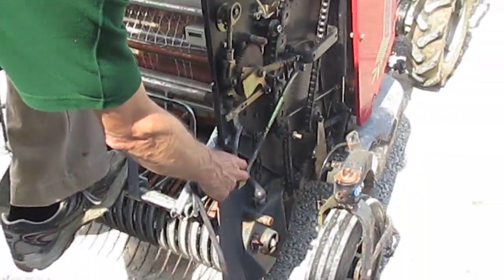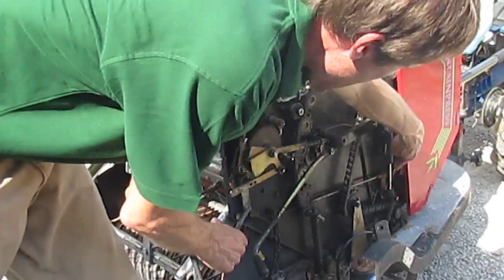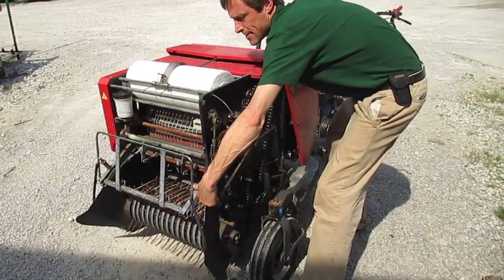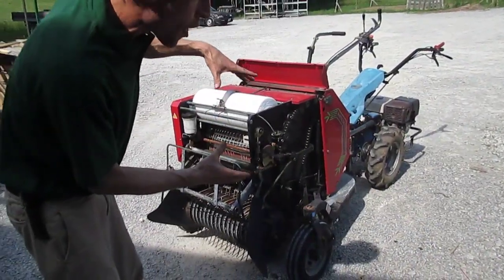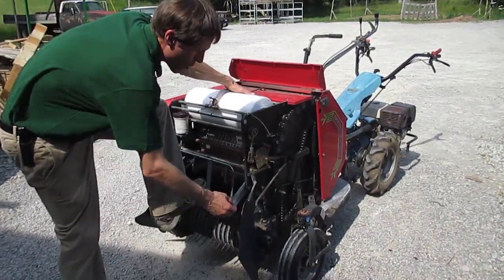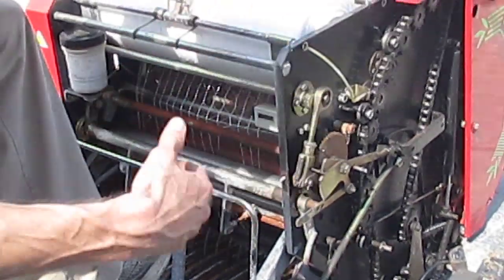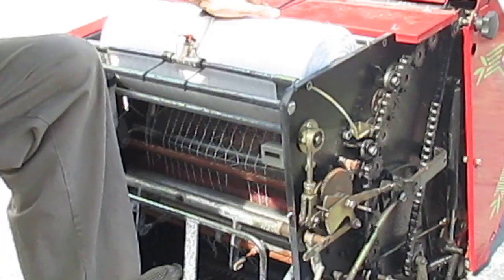This is the manual release lever for the bale chamber door. If you watch back here, that's the latch right there that holds the baler door shut. When I open that, the door can open. If you want to open the baler door manually, it's a stretch but you can do it with one person. Otherwise, when there's a hay bale in there, it has pressure pushing out, so as soon as the automatic release mechanism kicks, that door is going to pop open — you don't have to pull it open manually. Let's run through that baler function one more time: rollers kick in, rollers kick out — we're pretending it's wrapping the hay bale — baler door opens, you've got your bale. Now we're going to go over here and run some hay so you can see these functions in action.